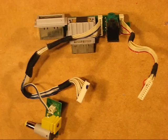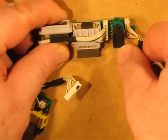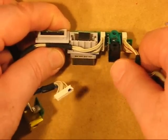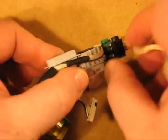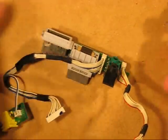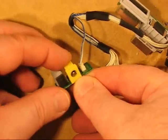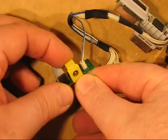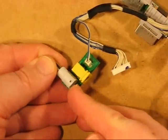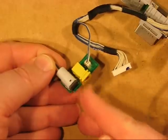The other parts we need to salvage from this PlayStation: first there's the black connector which is the audio-visual that connects to the audio and composite line. When that's cut off — literally cut through the four metal legs — you're left with this port. On the power side, the female connector will connect inside the box and into the portable where the batteries are located, and the male will be connected to the charger unit. When the two are connected, it will recharge the batteries in the system.